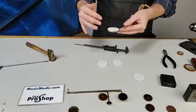All right. So Ryan's going to measure the inside. Do it with this one. Yeah, let's switch calipers too, so they can see the other caliper. All right, so here we are. We're zeroed out, 0 millimeters. Again, we're measuring the inside using these jaws here. This measures your ID, your inside diameter. Again, I'll take a look to make sure there's no old glue. Yeah, let's clean that out. So that's got a little bit of smudge in there.